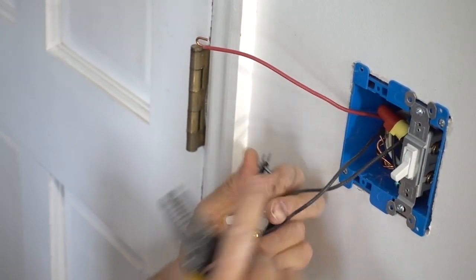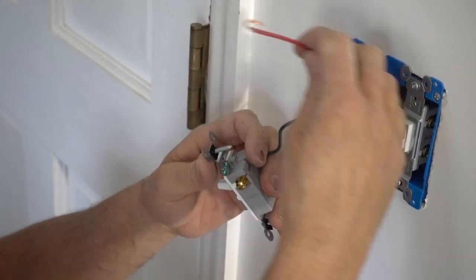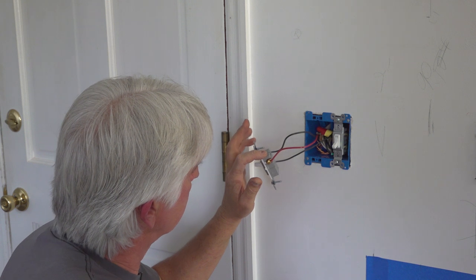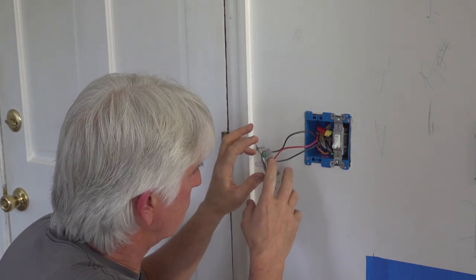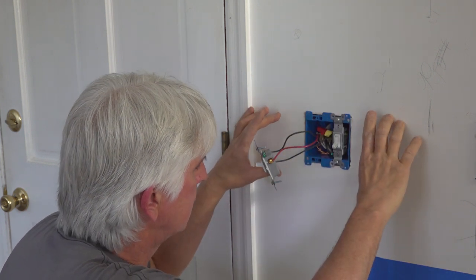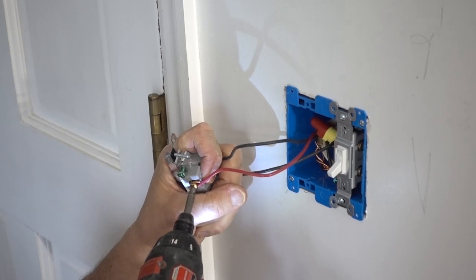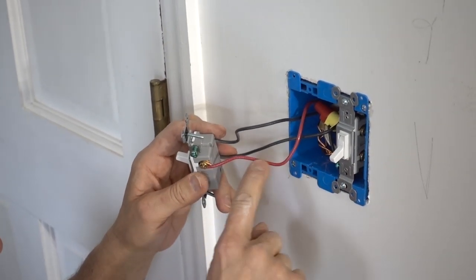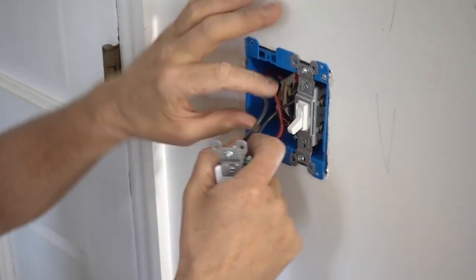I've got my odd wire on the odd screw, my traveler wire on a similar screw, and flip it around to put the other traveler wire on there. You'll notice there's a ground screw here. In our area of South Carolina, you are not required to have a ground on switches. Receptacles I wouldn't put in without a ground, but for switches I don't connect the ground because I'm not required to. And when you do, because these screws are so accessible and close, you've got a bare ground floating around in there. I can't tell you how many houses I've gone to where that ground wire hit one of these screws and shot sparks out the switch cover. If they required the ground, they should come up with an insulated ground so it wouldn't short out. But that's not my call — I don't make the rules, I just live by them.